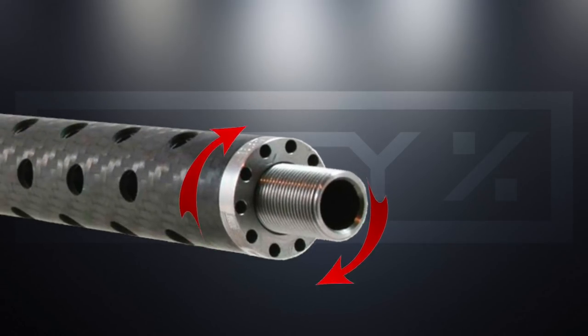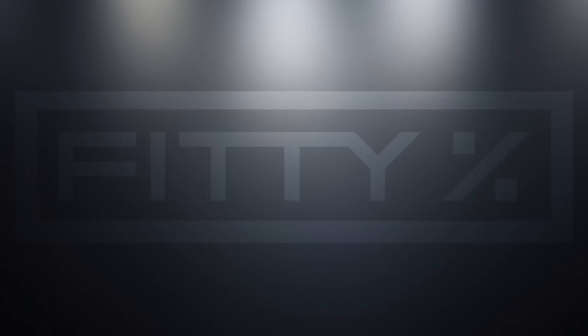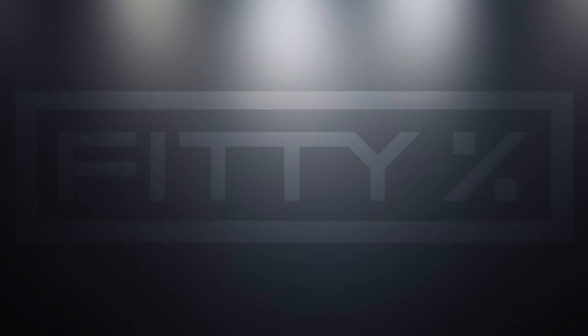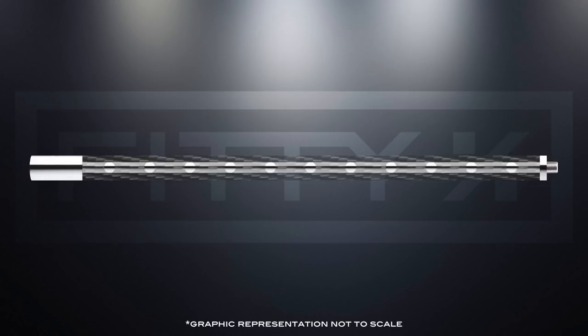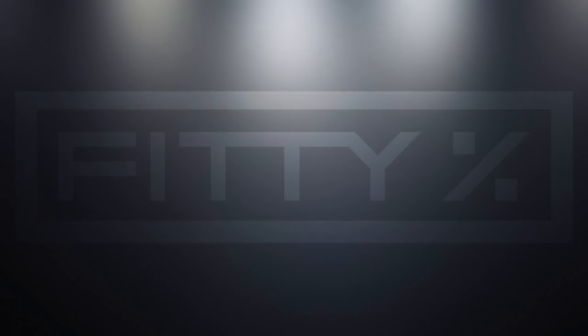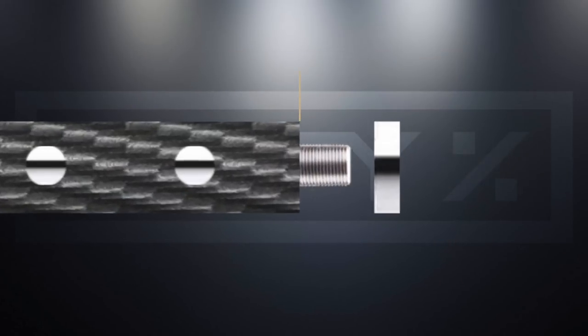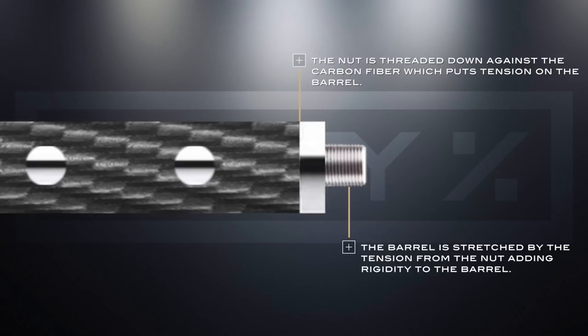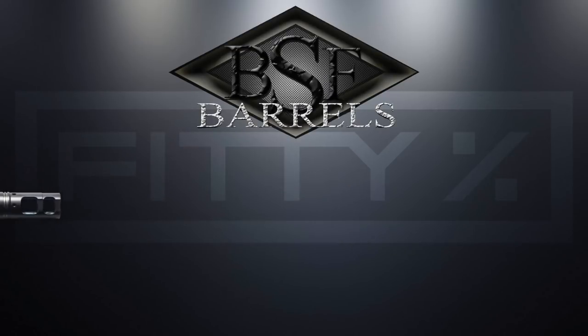The nut at the muzzle end is threaded down to apply pressure to the carbon fiber tube — think of it as almost like tightening a guitar string. When a wire is loose you can easily move it around, but as you pull the ends further apart it gets tighter and more rigid. The portion of the barrel inside the carbon fiber tube acts as the wire, with the rear of the barrel extension and the jam nut at the muzzle as the endpoints. The BSF barrel is threaded a bit further than a normal AR barrel so the nut can put pressure on the carbon fiber tube, stretching the barrel section between the two points to add rigidity. Because the carbon fiber tube is stronger than the steel barrel, that's how BSF adds more rigidity without applying carbon fiber directly to the barrel.